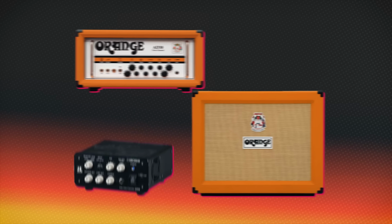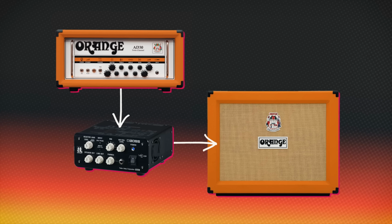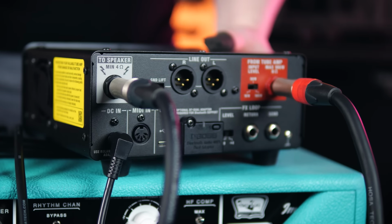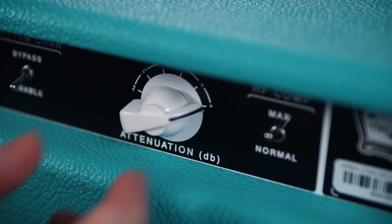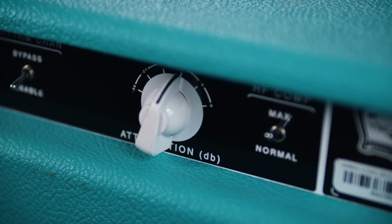Attenuators are devices that sit between the amplifier and speaker, absorbing some of the energy output by the amp so that the speaker receives a smaller portion of it, retaining the full tone of a roaring cranked up amplifier, but at manageable volume levels for your studio space. Most attenuators do this in a stepped fashion, engaging different circuitry to knock down the output level in distinct chunks.